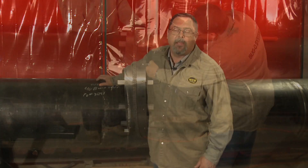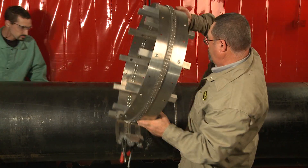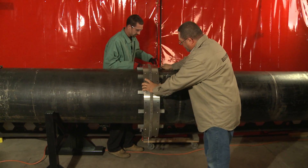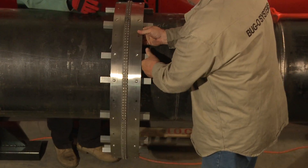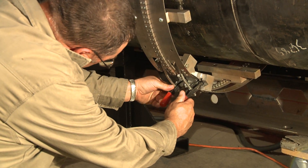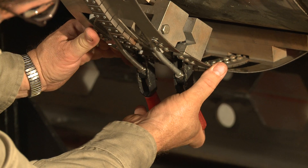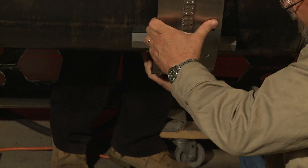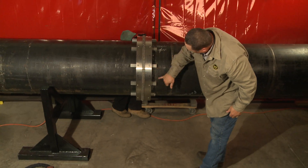We're going to start with the Piper PSR2000 ring rail. We've already marked the distance from our weld to our rail — it's about 8 inches away from the joint. We set it up with the teeth facing away from our weld joint, and you can see we latch just in one place. Press them together; we have to make sure that the tongue and groove line up, and they snap together. Isaac's tapping the ring rail into position so it aligns with the marks.